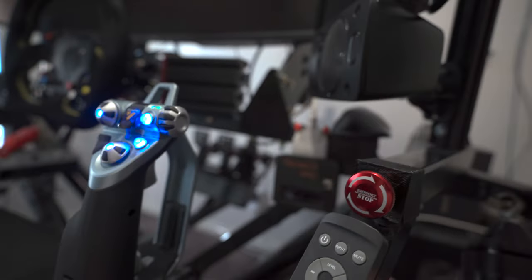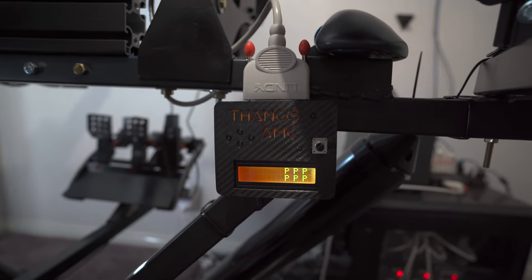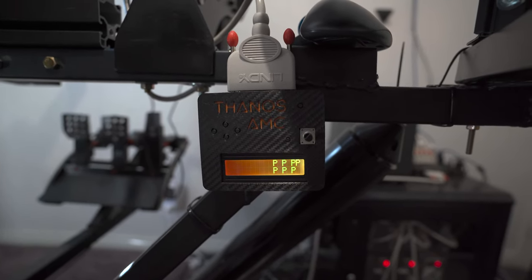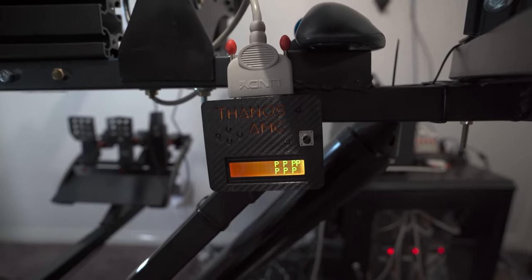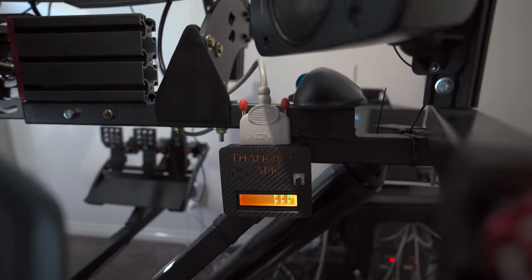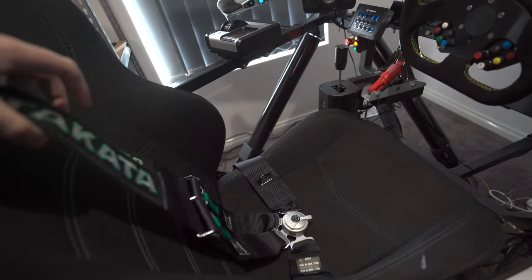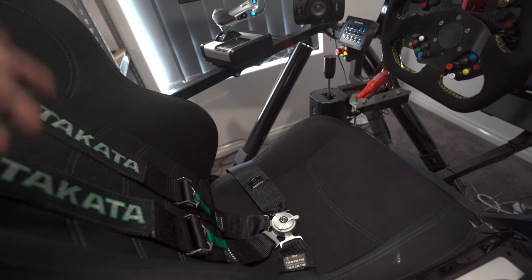So basically, let's see if we can get a picture up. You can see down there we've got all seven actuators and park point. If I hit that, it actually disables that driver, and then when I enable it, it calibrates by itself and puts it in the ready position. Now, the calibrating force is obviously set fairly low at the moment because it doesn't need any tension on it to successfully calibrate. So I'm going to do some tweaking in the AASD driver settings and get it so it still rolls, because I want to be able to fit the harness up, have the seat in position, flick the e-stop, and then have it pull back tight on my chest, calibrate, and go from there.